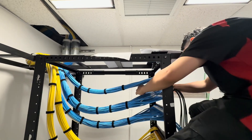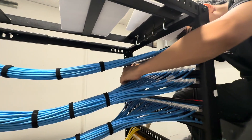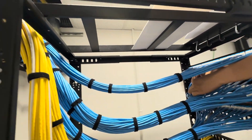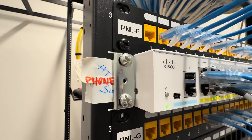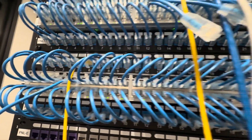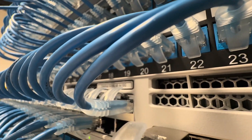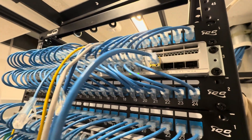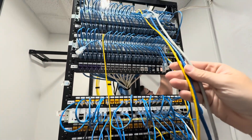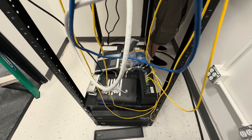This way, we can test and label, making sure that we've got the right cables in the right faceplates and that everything matches. You can see here that we've organized the CAT 6A by color and panel. These different color panels and cables have different purposes — they'll be labeled and patched into equipment depending on whether they are VoIP, IP camera, or workstation cables. One of the big challenges that we're running into on this job is that the customer does not want any vertical cable managers, which are fairly standard when you're using an open frame like this one. Without that vertical manager present, it's really challenging to organize the cable bundles as they go into the panels. So we're going to have to use a little bit of creativity to get this to look decent.